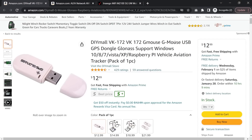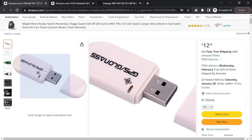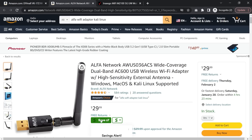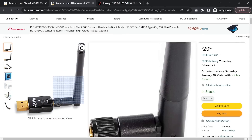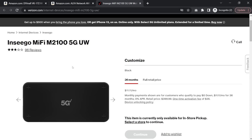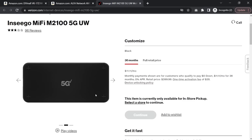If I were going to rebuild this and make it more efficient, I would probably use a USB GPS dongle instead of the long cable I had. I would also use a smaller adapter - they can get pretty tiny. This would be for replacing the Alpha card that's already on there. Maybe I would get a 5G card to strap onto the drone. This would then allow me to have connectivity from the ground, access the drone and all the data it's collecting, and be able to attack wireless and make any in-flight adjustments.